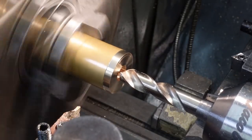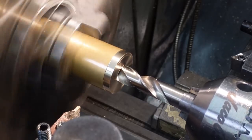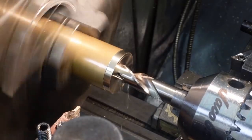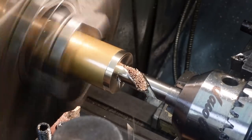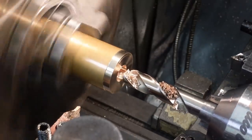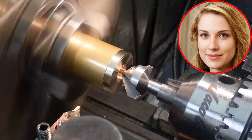The jaws are made from 30mm brass round bar with an M12 clearance hole, which, according to page 1660 of the Machinery's Handbook, is a convenient but sloppy 13mm diameter. In a wildly anti-establishment move, I'm making it 12.3mm. So radical, Ned Ludd would be very proud.